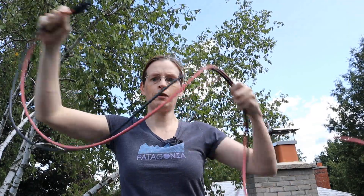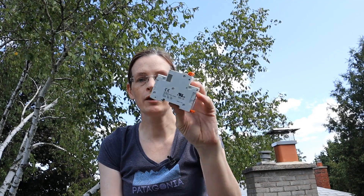What they did is leave me a couple of short runs that were already crimped — I think these are called MC4 connectors, since I don't have MC4 crimpers. So I can run them into the solar deck box. The current plan is: connect these up to the current panels, bring them in, tie them into the breaker. You've seen this before when I was building the breaker box — I've got two of them — and then drop the wires down into the attic.